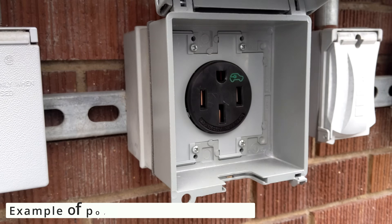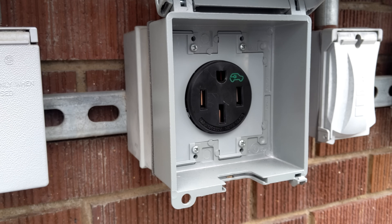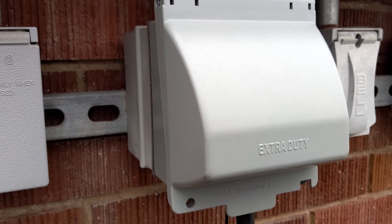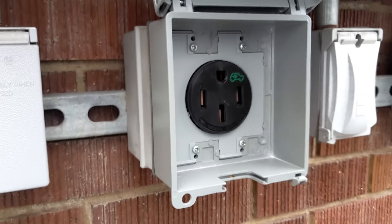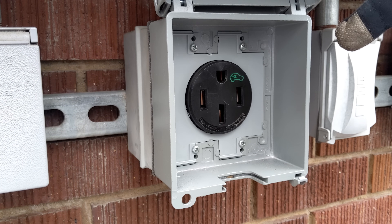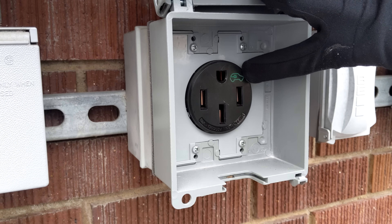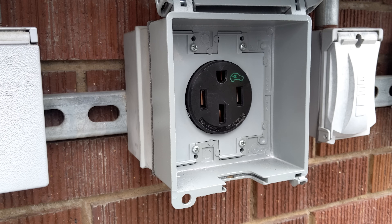Here's what a more powerful Level 2 plug would look like. This handles up to sometimes 9 kilowatts — on average around 6 or 7; when I've charged here I get up to about 5 or 6. The plug is very heavy duty and closes to keep the rain out. You can install these in your home as well, but be cautious — don't use a standard dryer plug. Those aren't designed for long periods of high output. You want a specifically rated EV outlet — look for the EV symbol. Do your homework and get one that can handle the load reliably.